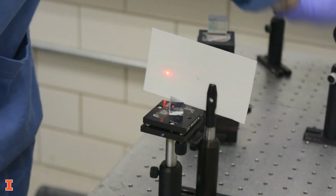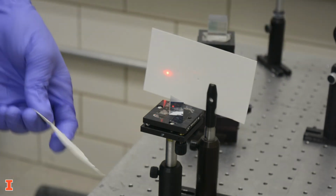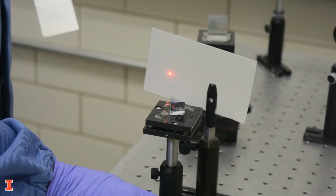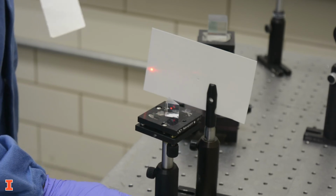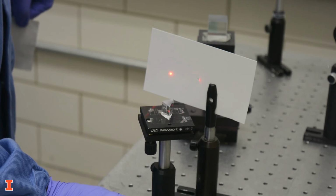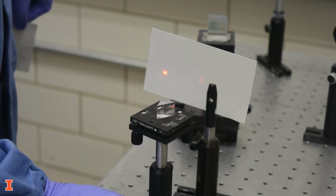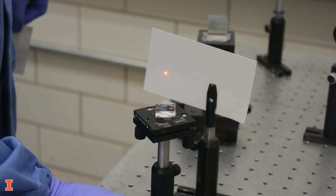A prism, depending on its structure and geometry, will also generate additional beams. However, unlike a diffraction grating, these beams are not spaced at regular intervals. Great care should be taken when aligning beams into these types of optics, and beam blocks should be used liberally for safety.